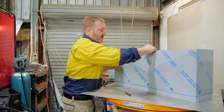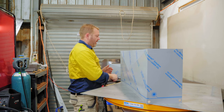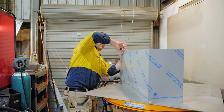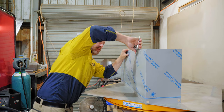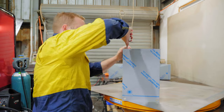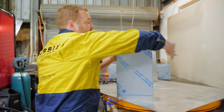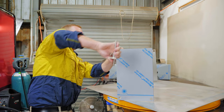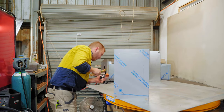This is actually a scratch gauge that I've put a piece of copper in and repurposed it. Some of you might be wondering, won't that scratch the stainless? The answer is usually you would, but because copper is softer than stainless, you won't actually scratch the stainless.